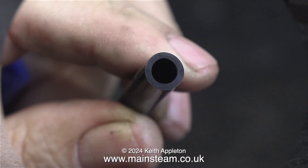I've bought some different silicone rubber tubing with a larger internal bore diameter — although it's supposed to be 6.4 millimeters, it's bigger and thinner-walled. If you push silicone rubber tubing onto a pipe of the same diameter, it's very difficult to pull off later. Often I have to remove it using a Stanley knife.